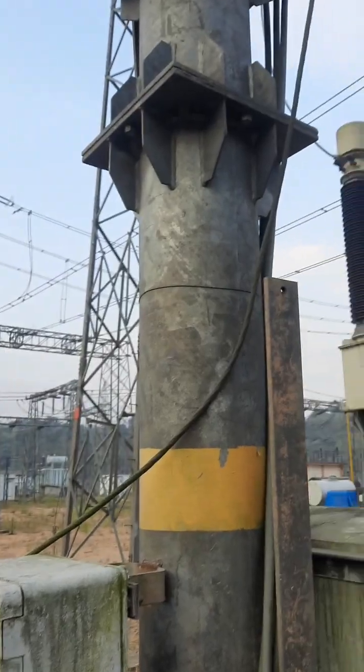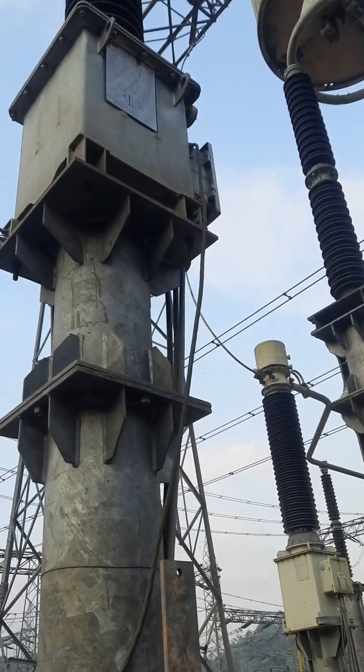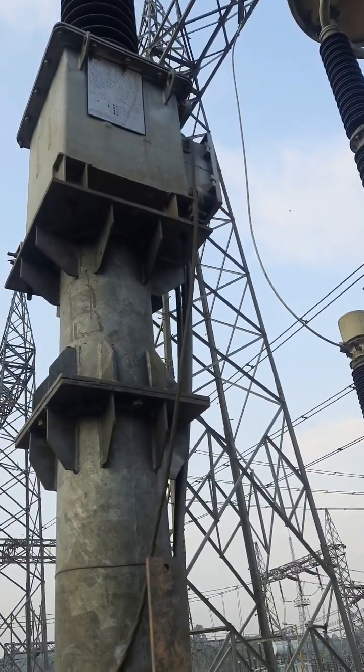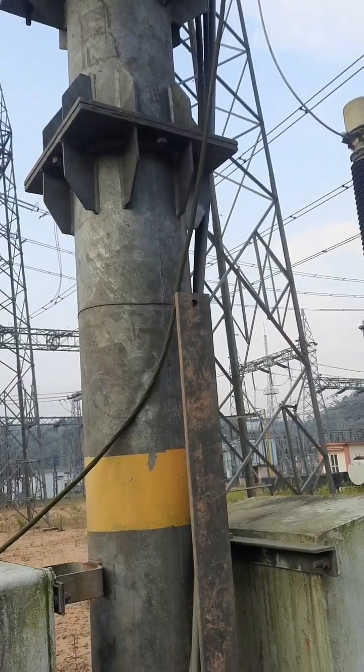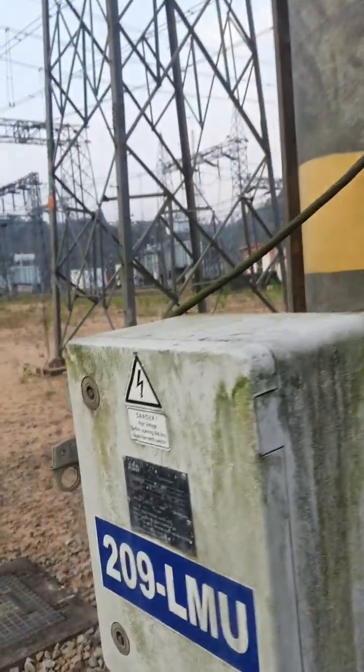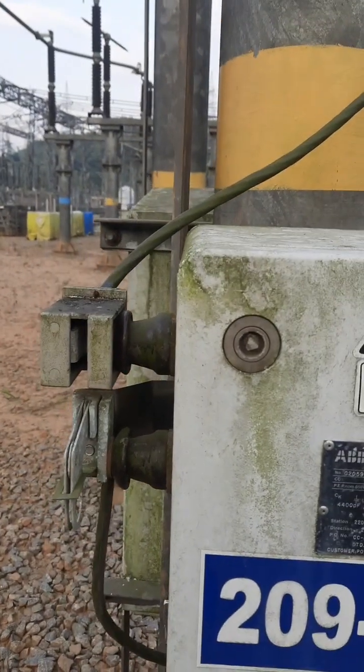This is the cable that you see here, an extra cable is there in Y phase. It is just a secondary carrier only. It carries the high frequency, and unless we divert it to the ground, it is going to go to our PLCC panel inside.